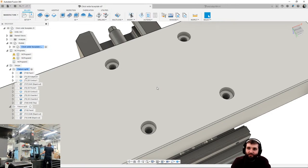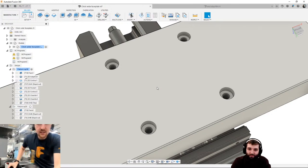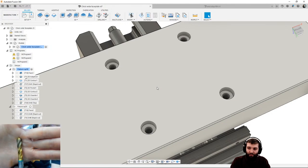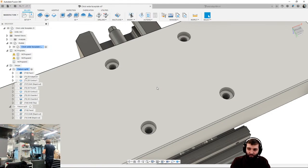Right, so a spiral flute tap is what I've got here. Let's grab this out and show everyone. So, this is our spiral flute tap. If I go the right way, you can see there that the flutes on there are spiral. They're helix flutes. What that's going to do is, when it cuts the thread, the swarf comes out of the thread, hits that angled wall, and shoots up. Because the flutes are turning around, if it was a flat wall, it would hit it and either go up or down. You've got a 50-50 chance of one way or the other. But because that wall is pointed back, as the swarf comes into that flute, it hits it and goes up, making sure the swarf comes up out of the hole.